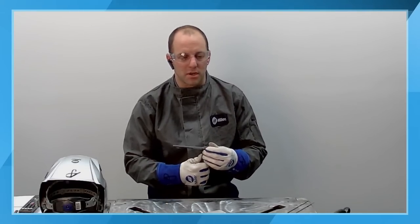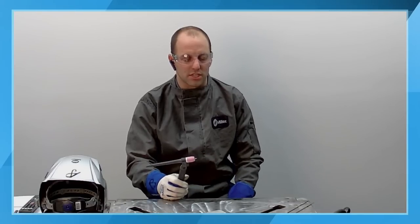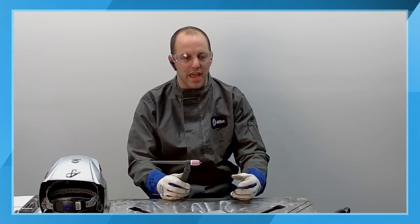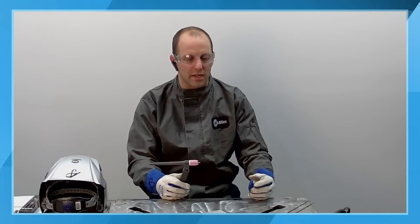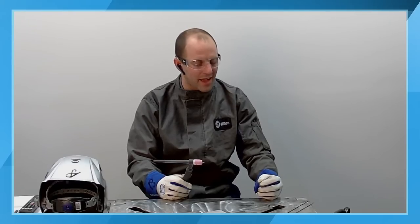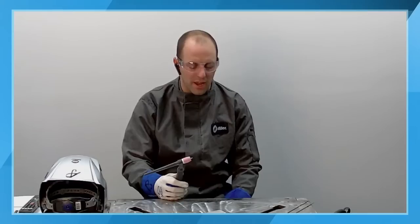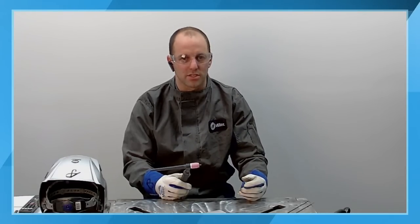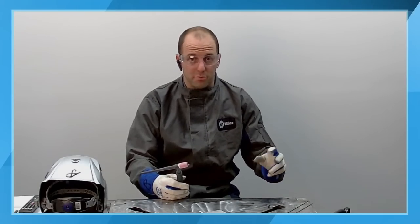If you're not having good results, there are a number of factors that can come into play. I got a phone call last week from a gentleman who was struggling to get a good weld. Turns out he had a bottle of bad shielding gas. It's not very common, but it does happen. That could be a consideration. So if you strike the arc and it flares up right away, it's almost always a lack of shielding gas, whether it's a puncture in your torch line, something not assembled properly, an O-ring missing on your back cap, maybe you don't have your gas bottle turned on, or worst case, you have a bottle of bad gas, or maybe if you've been doing a lot of welding, you ran out of shielding gas. So those are some things. If you strike the arc and the tungsten flares back right away, there's a good chance you have a shielding gas issue. Or your polarity is not correct.